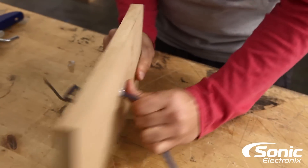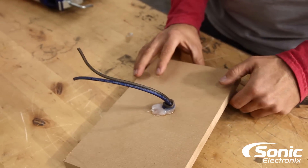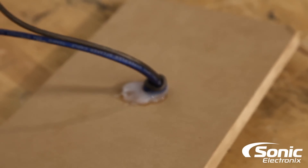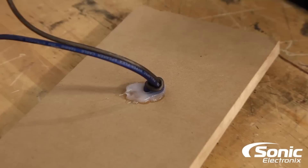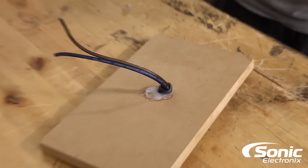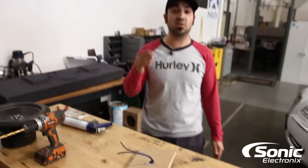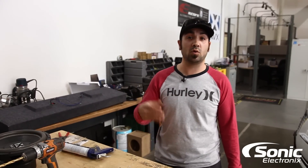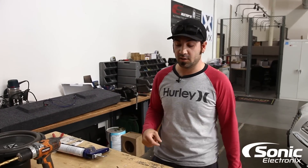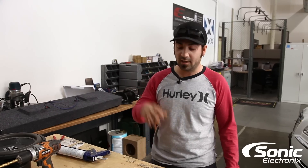You can also apply a little silicone on the other side just to seal it up. The key is letting the silicone dry — if you don't, you have the potential for an air leak inside the chamber, and that's what you want to avoid. This won't ruin the box or mess up performance as long as you seal the hole. There are also boxes without a divider — those are called a common chamber enclosure — but since this isn't a common chamber we need to drill a hole.